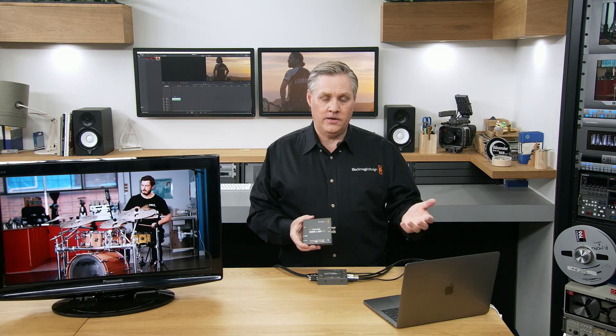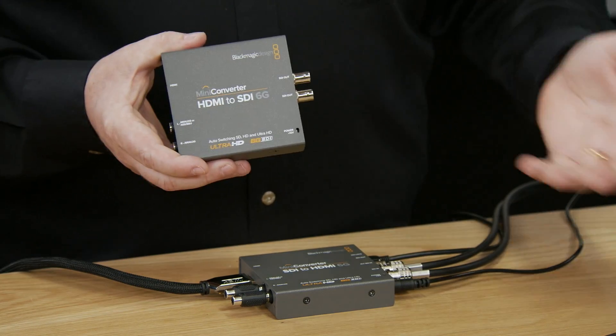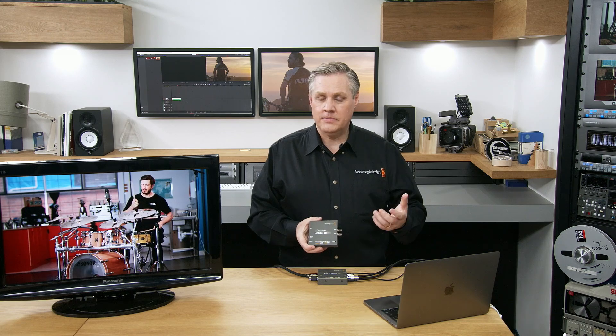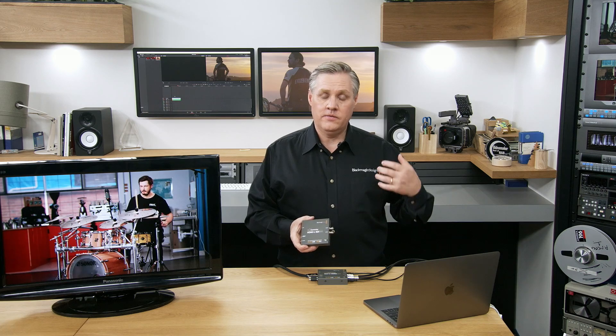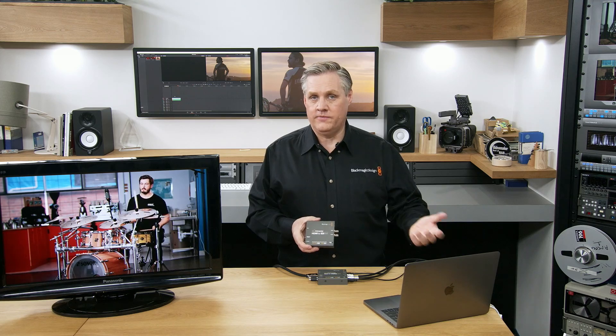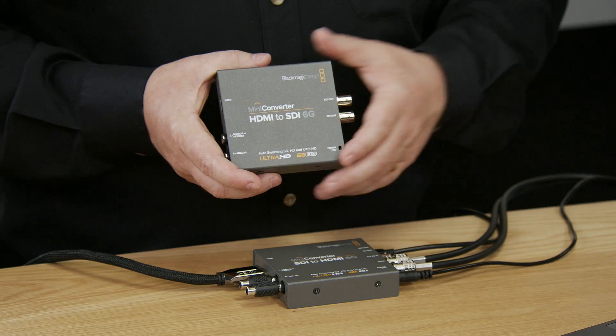It's great for extending HDMI cables because you can convert to SDI and feed quite long distances. It's also great for consumer HDMI devices like for live production switchers — you can really convert all those HDMI devices to SDI. You can also convert Skype: bring the other person up full screen in Skype and convert that computer's output to SDI. This is a great way of using Skype as a video link for interviews. System integrators and CCTV people can also use it.